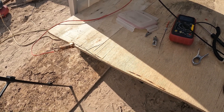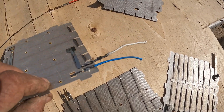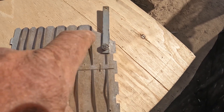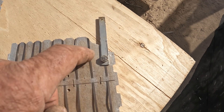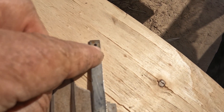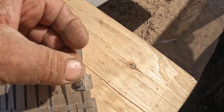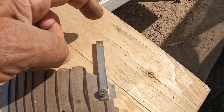It's an interesting little experiment. A couple things I learned from these toaster elements: the newer ones are spot-welded, and the older one I have is just put together with a little screw and bolt. So you can mechanically fasten this element material — you can't solder it because solder melts too easily at low temperature, and welding it is tricky on such small stuff. This older toaster used stainless steel straps with a wire wrapped right with a screw, keeping the copper wire away from the heat. The magnet sticks to the screw but not the strap, so stainless steel is the preferred choice.